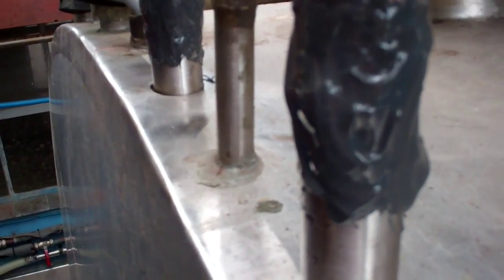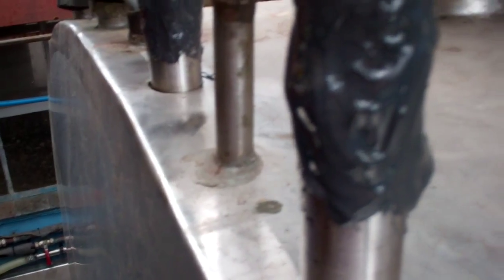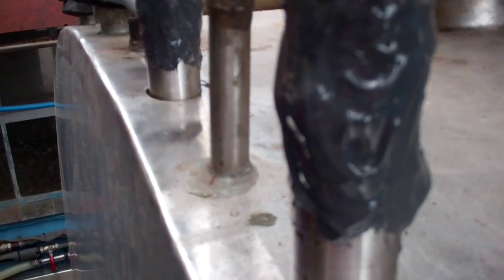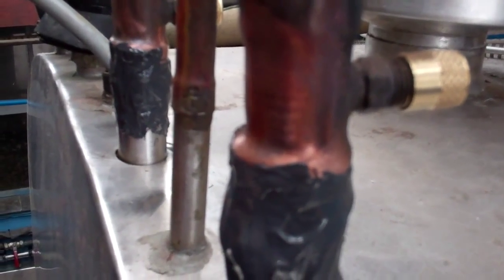Super epoxy I think - it's like epoxy resin stuff that you use for sealing up evaporators like domestic fridges. Just as a sort of belts and braces approach to it. We've got a vacuum pump going now. If there was a pin hole that would suck that into it a bit. But I'm pretty sure there isn't. Like I said we went over it all yesterday, but just to be sure.